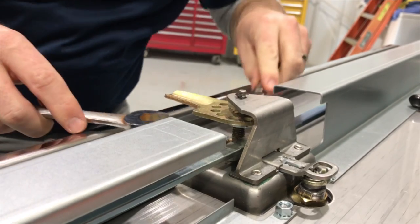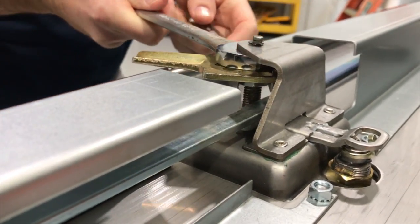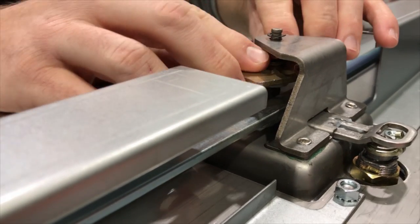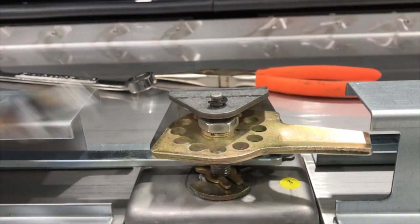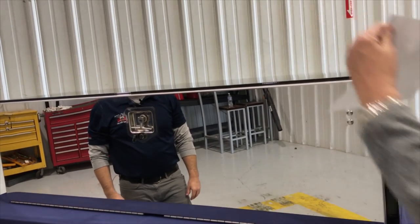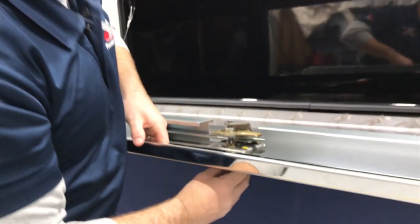Take our wrenches and we're going to loosen the latch. We're going to do a paper test again. That's pretty good, but I'm going to make it just a little tighter. Same process — just loosen it, then we're going to do a paper test one more time.